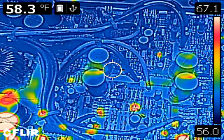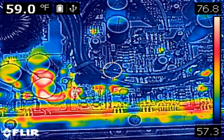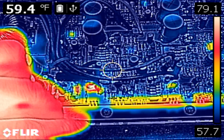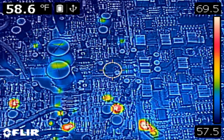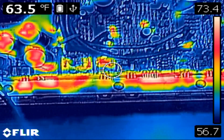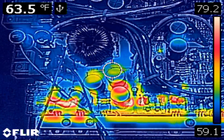Before I shut MSX off, I'm going to look at the circuit board. The amplifier is not on right now. What you're seeing is actually reflections — anything that is shiny or steel is going to reflect back at the camera and give you a false positive. You can cover it up with paint or tape. Right now I'm just taking a survey of what the board looks like before it's powered up. I'm getting a little bit of reflection off this heat sink, and all this right here is actually peeled-up solder mask from the circuit board.